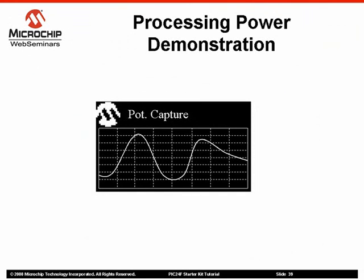Except for the title, the display looks identical to the graphing demonstration. The touchpad controls are identical: the left arrow slows the display, the right arrow speeds the display, and the center touchpad exits the demo. The difference is that while the graphics display is being updated, the potentiometer readings are also being stored to the file Capture.csv in the root directory of the flash drive. Do not remove the flash drive while this portion of the demo is in progress. If the flash drive is removed while the application is writing to it, the flash drive will be corrupted.